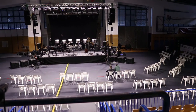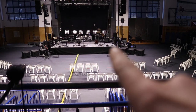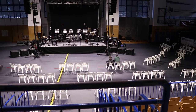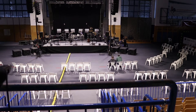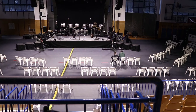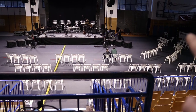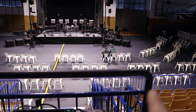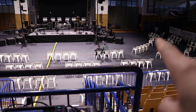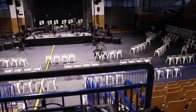What is maybe interesting is the placement of the woofers. Since we have all that space in front of the stage, we now have them in an end-fire array placed at about a 50-degree angle, and that means that we can sort of steer the subs towards the sides as well. So we are basically creating this shape for the subs, and that means that the people at the far edges of the audience placement can have some sub information as well.